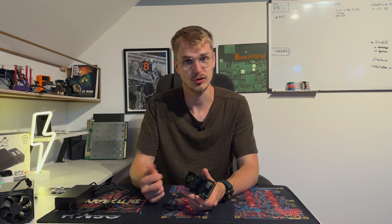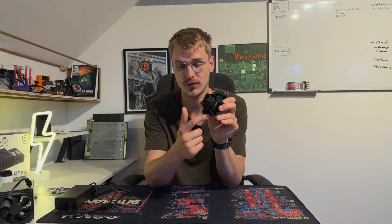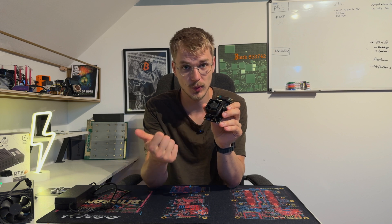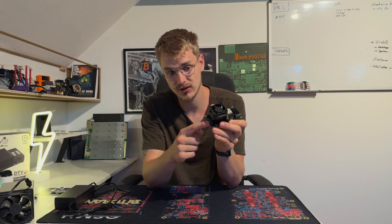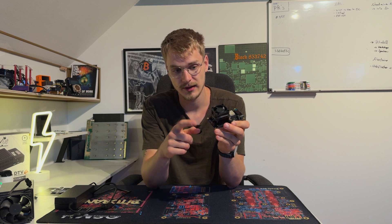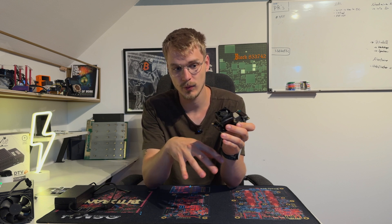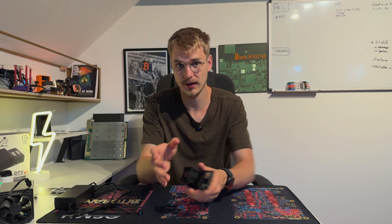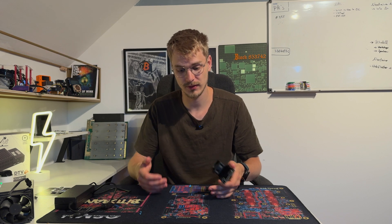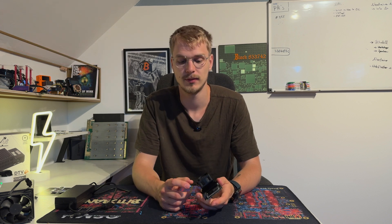The BitX itself can only control one single fan, and you do have two fan headers on here but only one fan controller. So even if you put another fan into the second connector, it would only control one of them. The firmware will get confused because two signals are coming back to the ESP showing two different RPM values. So it works, but don't expect too much magic from it.